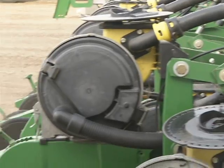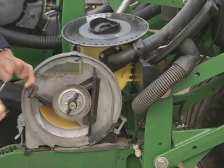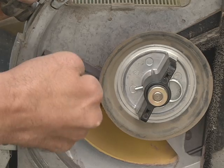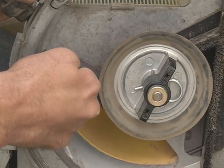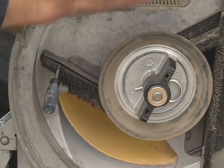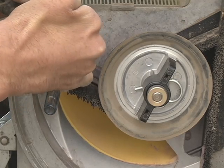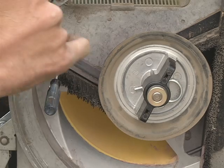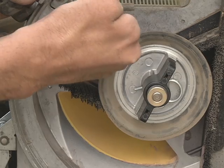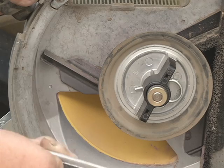To remove the bristles, take a tiny little flat screwdriver and, very carefully, insert it in the top of the bracket, between the bracket and the brush. Wedge it in good and firm, and then you want to try to push it up and over. You don't want to put too much pressure and break this plastic part off, but you want to wedge the brush out. It's kind of delicate and you're going to break a few, it's just life. You break it or pop it out like this. Once you get it out, you can grab the other side and wiggle it out.